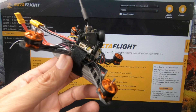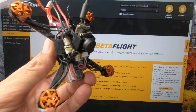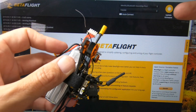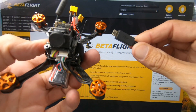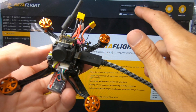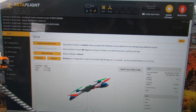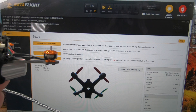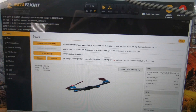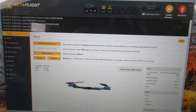Once you have the latest version of Betaflight installed on your computer, take your drone — don't plug it in yet; I just have the battery on there for now. Take your USB plug and plug it in. You should notice changes, and if it tips forward, back, left, and right, everything's correct as far as orientation goes.